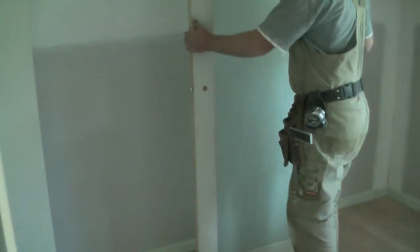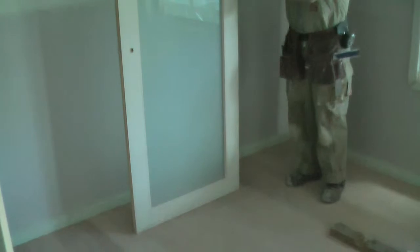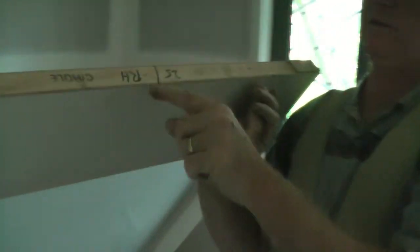This particular door is a glass door. To make sure we've got it the right way up — because it's not obvious which end is top or bottom — we look at the hinges. Facing the hinges towards us, the latch is opening to the left, which is the wrong way, so the door is probably upside down. If you have a look on top of the door, it's upside down. I'll just spin it the other way so you can see it correctly.